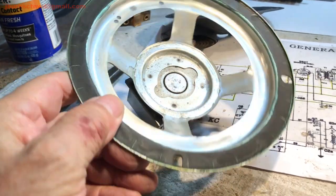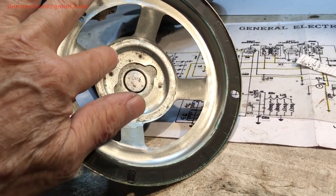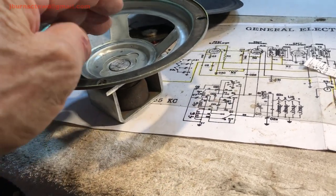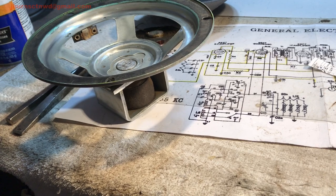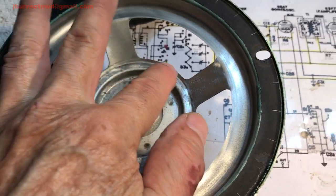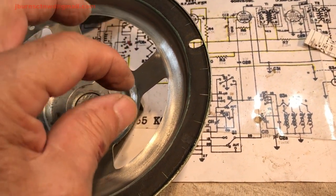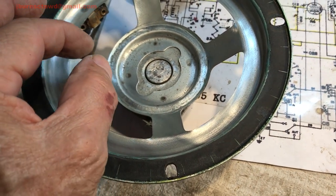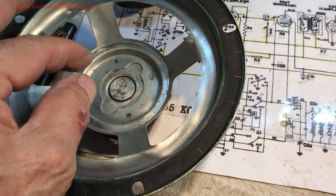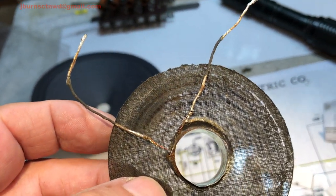That lacquer thinner works really good. Put it on a little cotton swab, or soak the swab, and swab it around the basket here. After about 5 minutes or so, she loosens up. The glue loosens up pretty good, to where you can start peeling it up real carefully, incrementally, all the way around the thing. It will get super tacky, so you got to keep up with it. And it comes right loose.